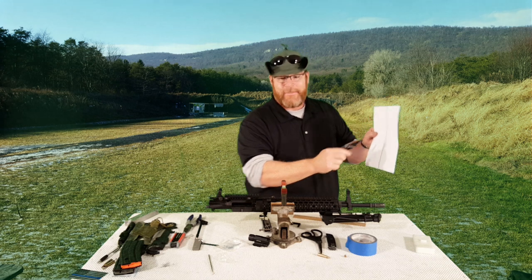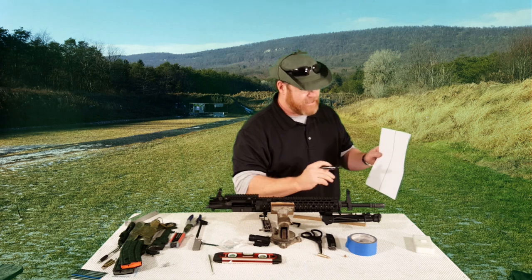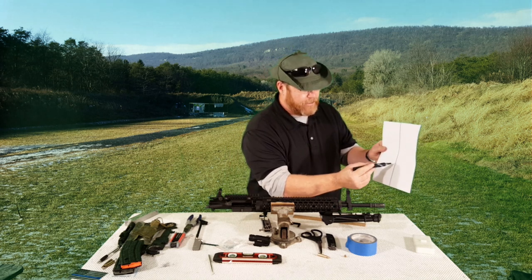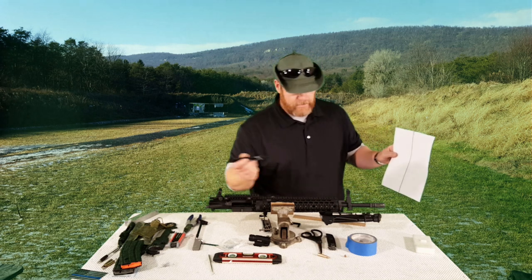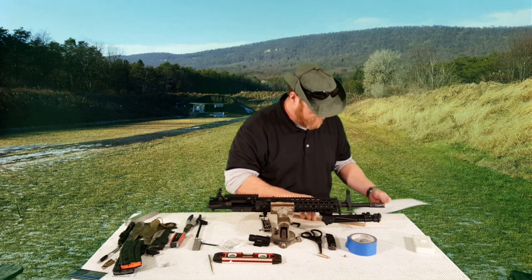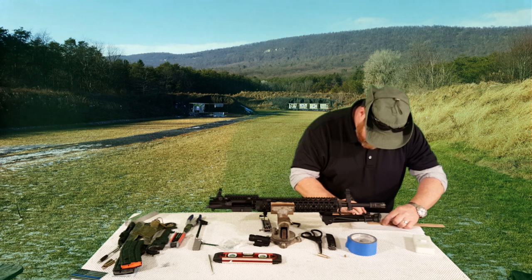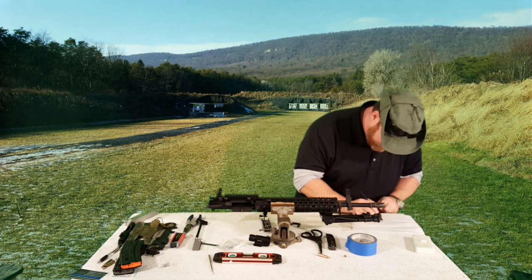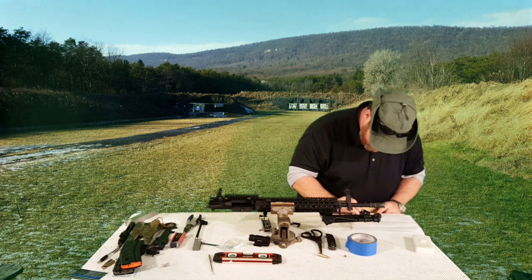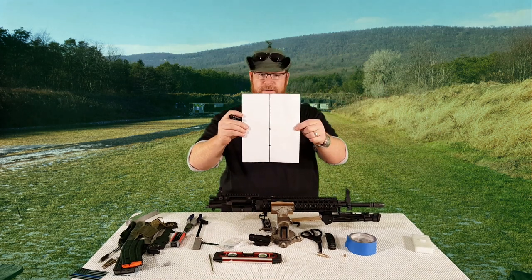Because I'm only one person, it's going to be kind of fun to do, but you'll see how I go through the whole process — I'll edit that portion of it out. We're going to mark a little dot here where the bore is, and 2 and 5/8 inches up is where our sight from front or rear to the front will line up. So I'm going to go ahead and mark my lines. There are my sight differentials.